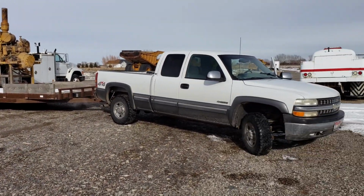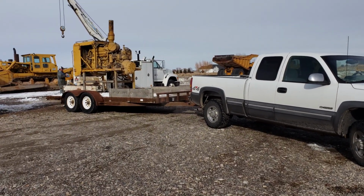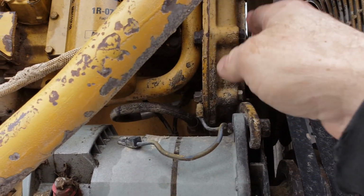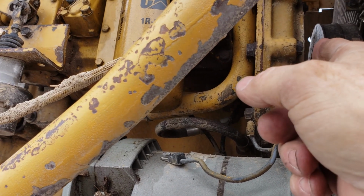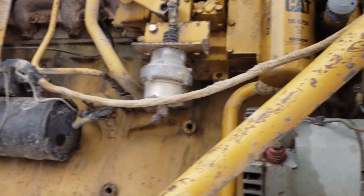Okay, this is really all Chevys are good for. A tote. Okay, so we'll have to take the radiator and the hard nose off. We have to pull the whole front cover off to get to the fuel injection pump drive gear, which has a variable timing advance in it. That's got to be worked on and replaced.